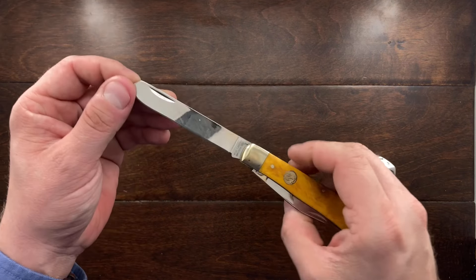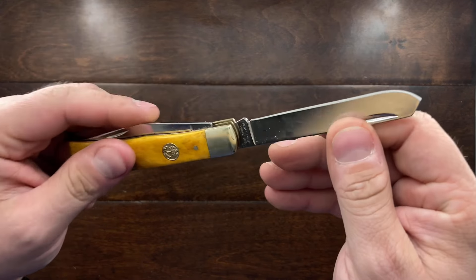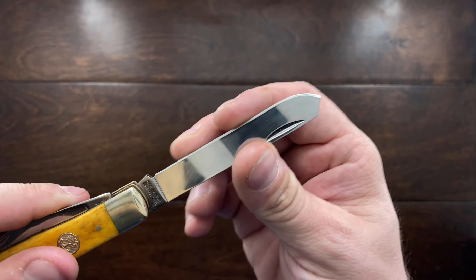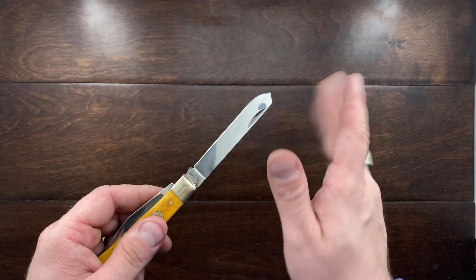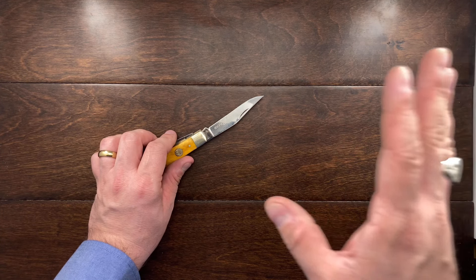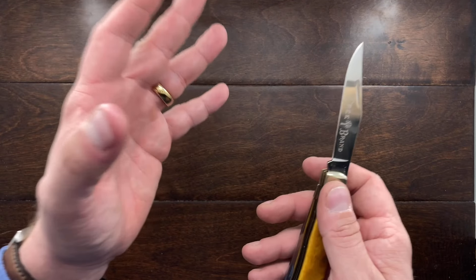I have found it to be absolutely wonderful to use. Now was it sharp when I got it out of the box? No. It would cut rope but it really needed a serious stropping. When I got this out of the box the blade edge was not that great. I actually ended up taking this on a polishing wheel, polished out the edge a little bit, then stropped it out. And it got it down to a really rough hair-shaving sharp finish — barely shaving.